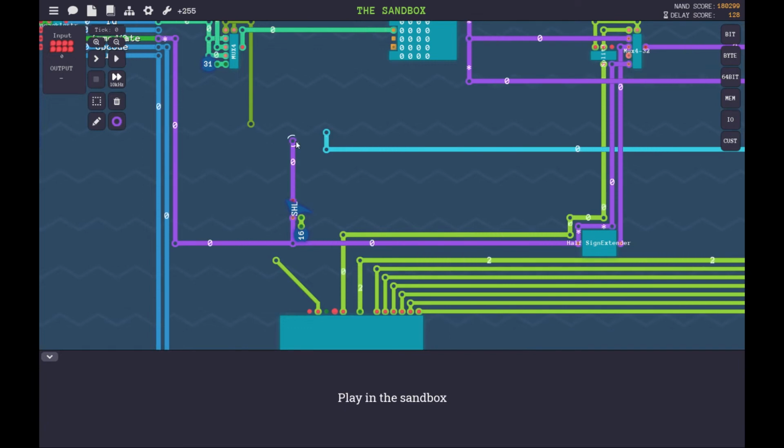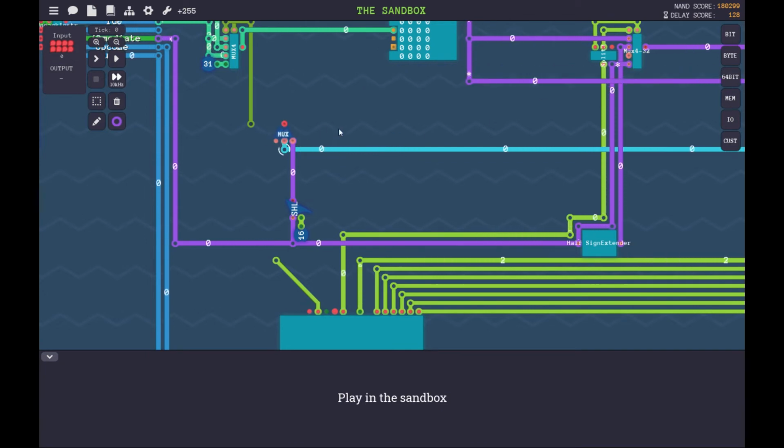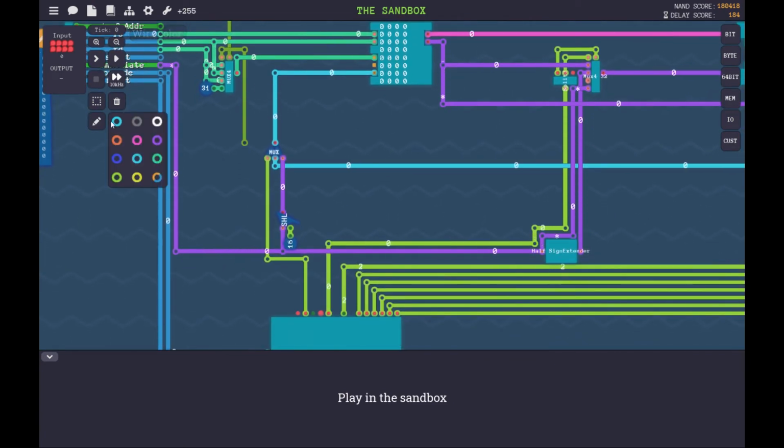And all we need to do is now pick the correct value between the upper immediate and the computation result. And like always, we're going to do that with a multiplexer, and then connect that multiplexer to our control signal, like so. Okay. Great. So with that, we now have the computation result over here, and we can just send that straight into the write data over there. And then finally, there's the write enable pin, which is this output on the decoder.